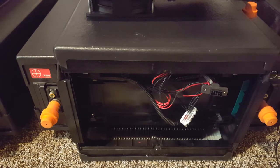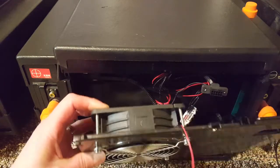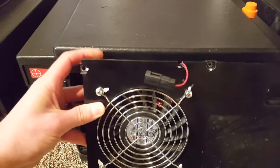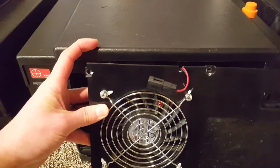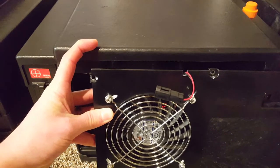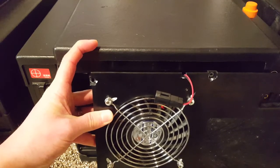This also came with a 24 volt fan, and I'm probably going to do a video in the future describing what I'm planning to do with it. At 24 volts it's extremely loud, so I'm actually going to undervolt it with a buck converter that you might have seen earlier in the video, and I'll go through and describe how that works.